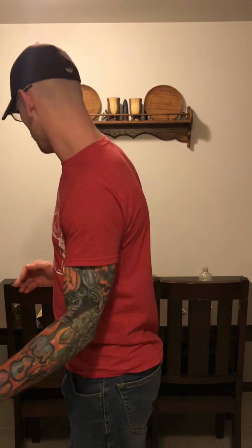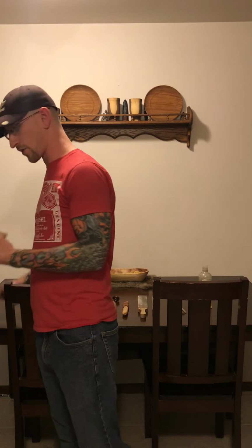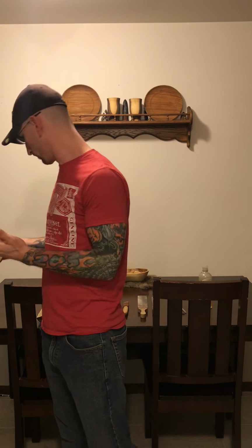Number one being your wood selection. This is butternut, this is black walnut. These will both take a pretty good finish by themselves, with no oil necessary, to be quite honest. I still use oil, but this stuff really lends itself to a good finish to begin with. And these are both hardwoods, mind you. Any close-grained hardwood would generally be pretty good. You want to stay away from softer woods for the most part, like pine.